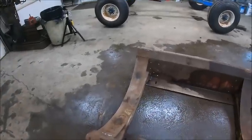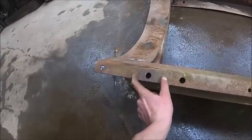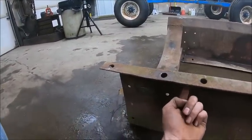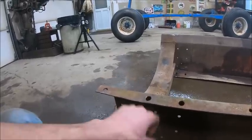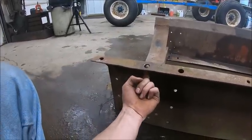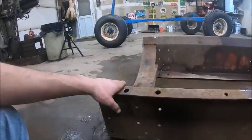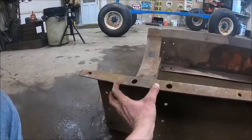And I think what I'm gonna do is cut some, probably 3 inch long, it'll be plenty, pieces of whatever I can find for scrap flat stock to get 6 pieces out of, and punch a 1/2 inch hole in them, and weld some straps in underneath these holes to reinforce them a little bit so that they don't pull in, because clearly the way the straps were jacking up into the hole and trying to pull through, that steel's not heavy enough. So we'll weld something in there to reinforce it so that it's got more bearing surface to work on.